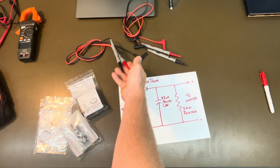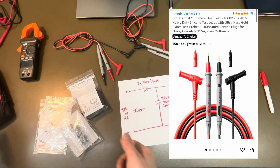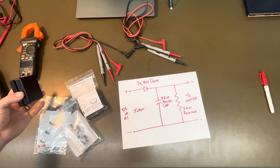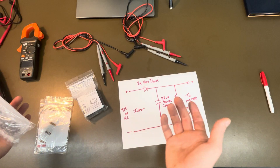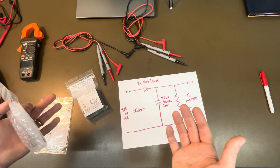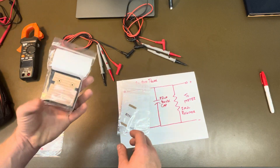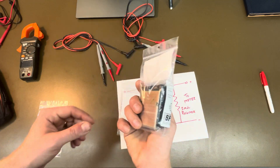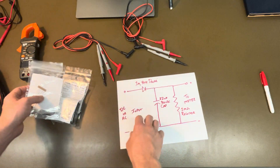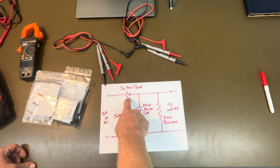The capacitors were a couple bucks but very simple and easy. I got test leads — universal test leads that fit the Klein meter and every other meter. I got two sets because I'm going to make two of these. For all these parts to make two, I'm into this for maybe thirty dollars. You can even plug it into an outlet and see what your peak voltage is — it should be a clean sine wave. Let me put this together: I'll solder everything and put it inside my project box to use for troubleshooting the stator. The resistor doesn't matter for polarity, but the capacitor and the diode do matter.